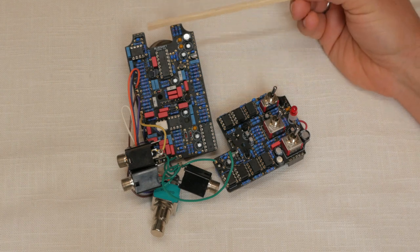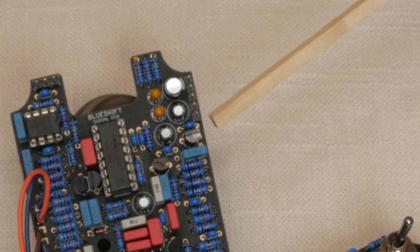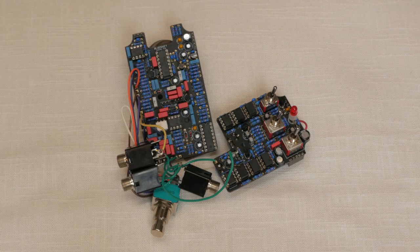When installing these, I usually solder one corner and then the corner on the opposite side. Once you've made sure that the header is flush and straight, you can solder the remaining pins. Once you have things lined up nicely, you can solder the pins easily. This will allow you to get a snug but not too tight connection between boards.